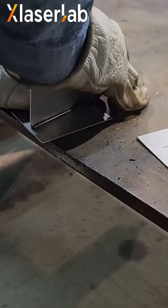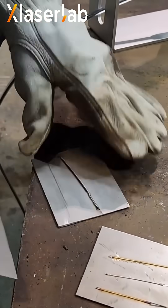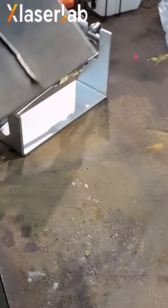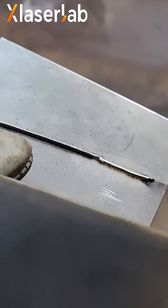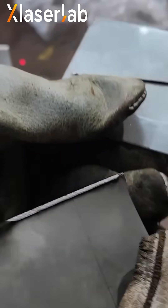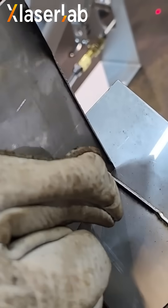I see a lot of people trying to break against the weld, or you weld it on double sides — well, that's so strong you're not going to break it with your hands. But that was stuck together pretty good. And 100% penetration on this piece. I didn't have my aiming quite right, so it wasn't all the way underneath.